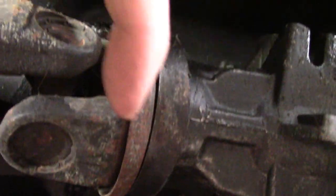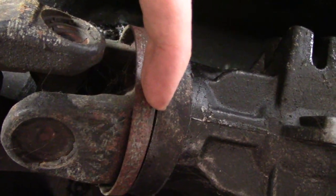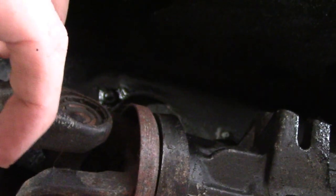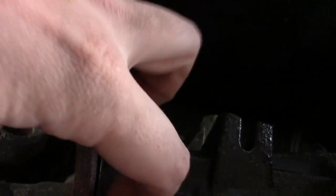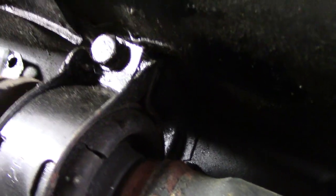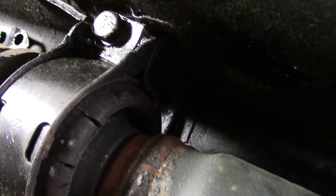Solutions include replacing the prop with an ABS prop, which would be an inch shorter and give about 25mm of extra play, allowing a repair of the gearbox end. The gearbox itself doesn't appear damaged per se — it's the aluminium housing parts that got chewed away easily. But for now we're stuck with it, and these parts are not easy to find after 25–26 years.